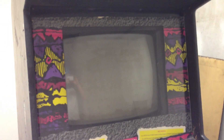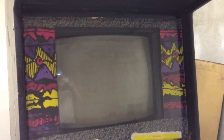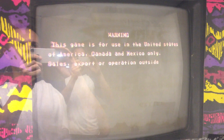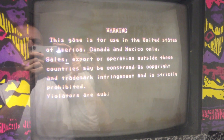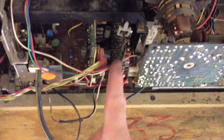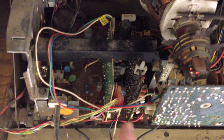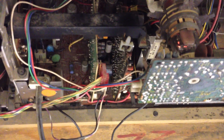Okay, let's switch it on and see how it works. There we go. So, check the solder joints next to the high temperature areas. In this case it was an IC chip that's on a separate board. You can even give it a little bit of a wiggle to see if it changes your display at all.